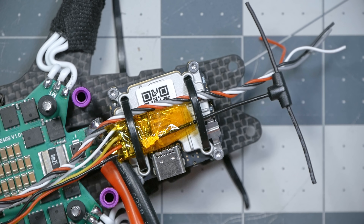Another major change is the receiver I'm using — I am switching to ExpressLRS for my daily builds. Why am I not using Crossfire? Crossfire is great, but I like the more advanced stuff being done by protocols like Ghost and ExpressLRS: higher frequency, lower latency, cool innovation. I was using Ghost before and I still think Ghost is great, but ExpressLRS can do pretty much everything Ghost can do and more. It can go up to one watt, so if I want more output power I can transmit at one watt and get all the range I could possibly want, whereas Ghost maxes out at 350 milliwatts. I've gotten comfortable with how to set up an ExpressLRS receiver and module — it's quick, it's no longer inconvenient for me, and it's just where I want to be.